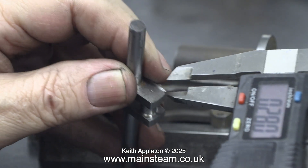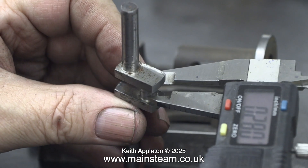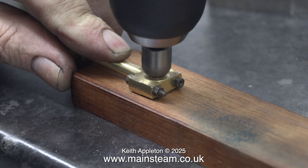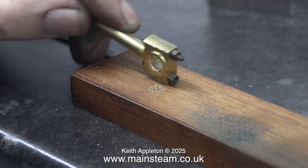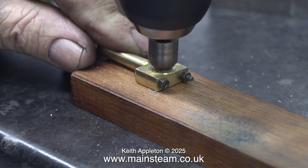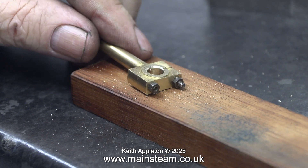After the work I did on the crank pin using a needle file, I'm pleased to say it's the right size. As you can see on both sides of the crankshaft and the crank pin, the number remains the same on the digital caliper. This is important because the crank pin is rounded where it meets the main casting, so what I need to do is just lightly countersink each side of the big end of the connecting rod to avoid the risk of any binding.